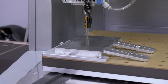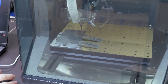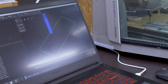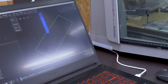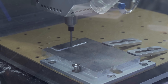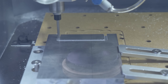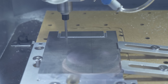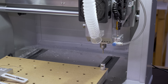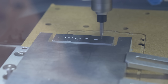I'll start by cutting the contour of the branding iron with a flat bit, leaving some tabs. It seems the ventilation with air works correctly for clearing aluminum chips. Even though I didn't manage to record it, at some point almost at the end the bit broke. As there wasn't much left to be done, I'm not going to start from scratch. I'll continue the project by cutting the relief with an engraving bit, and finish cutting the aluminum by hand.